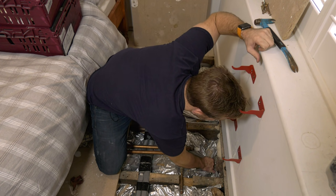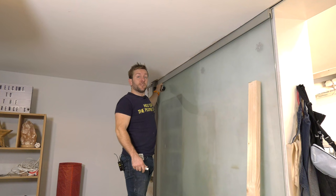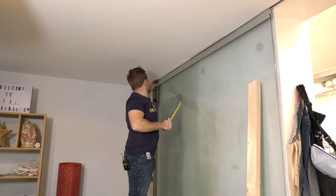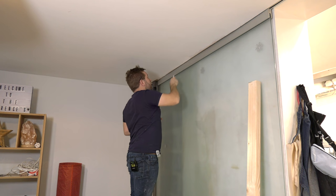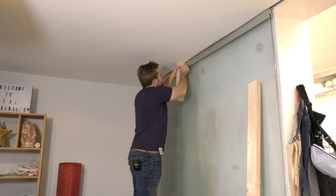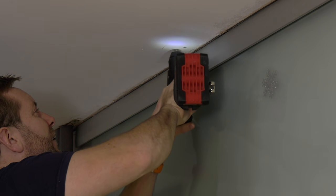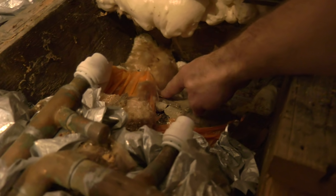What I'd like to do now is we just wanna pick this away - this is where we get a little bit of dust going on. We can see down there, that is roughly where we're hoping to come up in a minute. What I did upstairs, rather than measuring from the end wall, I know where these pipes drop down - the flow and return for our secondary return system - and I can measure from those pipes across, and that was 80 centimetres. So that means we should be looking to make a little investigative hole just there. My wall is gonna be roughly this wide, so I wanna give myself a distance width to go from. So really I'm gonna wanna drill my hole here. Let's pop this up and go and have a look upstairs to see what we can find. You guys can't see it very well, but look - it's right there. That is the end of our screwdriver sticking through. Magic, we're all good.